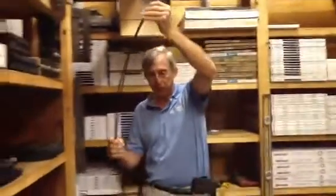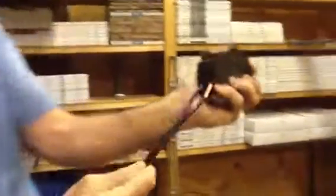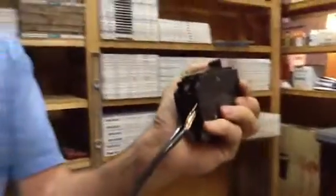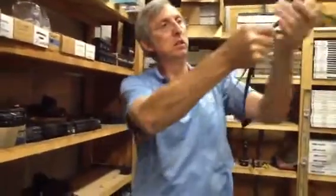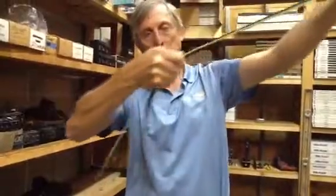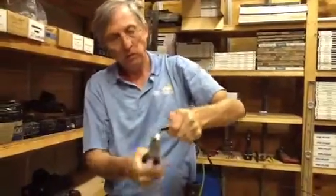Here is the 220 part of my electrical whip — we have two hots, because remember, we're doing a 40-amp circuit, so these wires will go under the breakers. Now you might ask about a ground: take a number 10 ground — you can always reduce it one size. The ground wire should always be green, or you should mark it with green tape so it's clearly identified. If you get it crossed, it'll trip the breaker. Take your ground wire and make it the same length. Now we have our two hots and our ground.